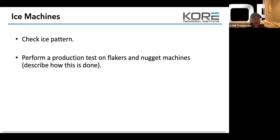So what the tech support is going to ask you is a couple things. Water temp, water inlet temp. So what that means is when you guys, if you're on a Hoshizaki and it's filling and it hasn't gone into a freeze, so there's no mechanical refrigeration in play at that point, you're just testing the water coming from the city, or coming from the supply. You're going to drop your case style thermometer in the sump and you're going to test that water.